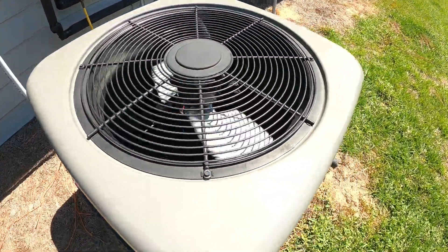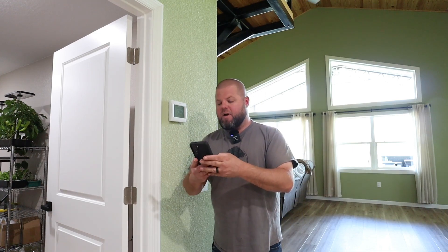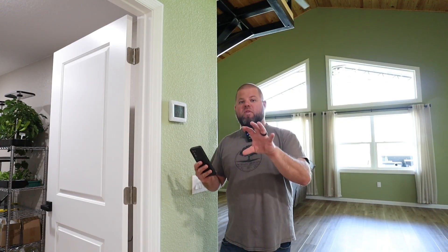It's running, everything sounds perfectly normal. Some quick math: we have 30 amps of capacity here and we should be right at it with the wattage we're talking. A four-ton unit — keep in mind I only have two-ton — the higher the SEER rating, the lower the amps; we're talking around 17 amps, almost half of what these units are capable of. The majority of the surge is that inrush current right when the compressor starts; soft start really helps there. My two-ton shows around 8.5 amps running, and the data plate showed around 12 amps maximum draw.